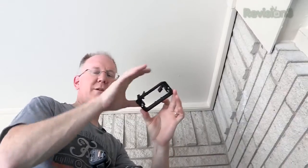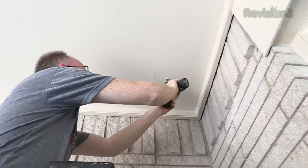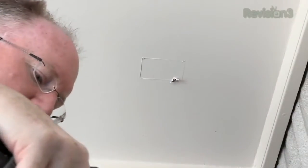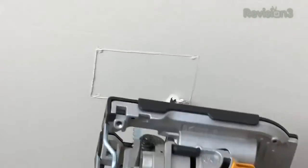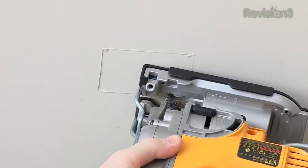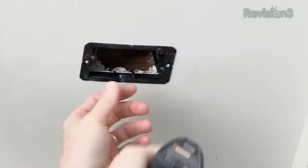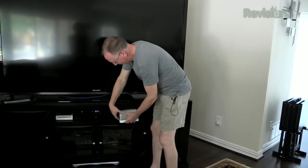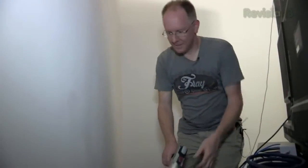We need one of these little junction box frames in order to mount the jacks for the speakers. I need to mark the hole, drill a larger pilot hole, and then use the jigsaw to cut it out. We're going to mount the Connect Amp right here in the entertainment center, which means we need the speaker wires run in the wall directly behind it.